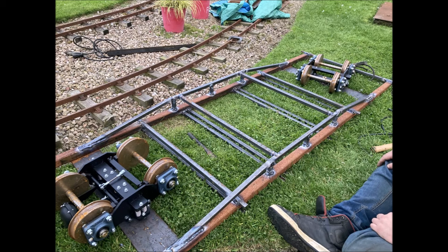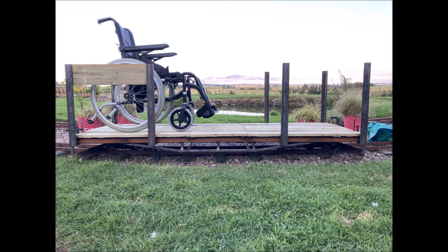We also added additional bracing under the main 40x40mm box section chassis rails, because we found they flexed quite a lot when loaded. With the chassis widened and strengthened, we checked the deck boards would sit correctly in place, and added vertical supports for the carriage sides.